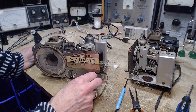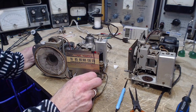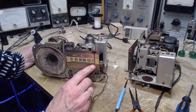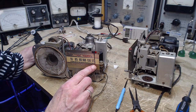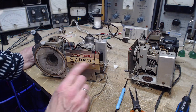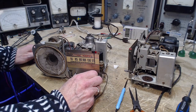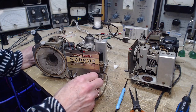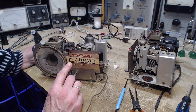And the other way, it's just being dragged along on top of the string. So next thing we do is look and see, does it stop dead on 170 and 55, or does it stop right at the end of the black bar? Let me try that. So right at the end here. Now, hopefully, yeah, the knot actually is going to keep the pointer lined up. What we do is just pass, but not by much.